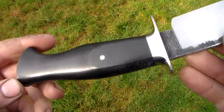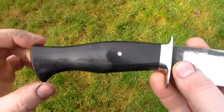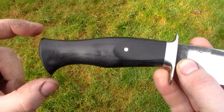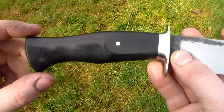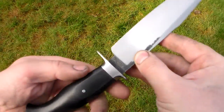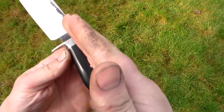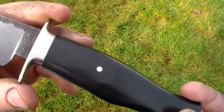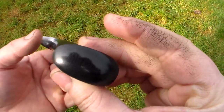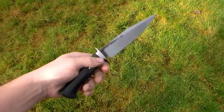What makes this unique and unusual for a knife handle is the parent stock has to be at least as thick as what you want the height of your handle to be. This particular piece I believe was about one and three quarters thick, so that's pretty unusual to come by. It changes the direction that you see the canvas layers, which I think is pretty cool — but that's up to you to decide.